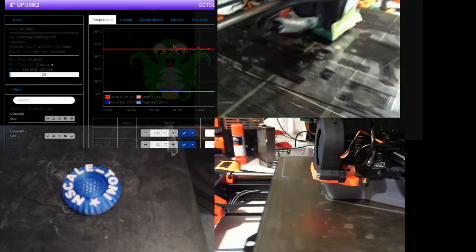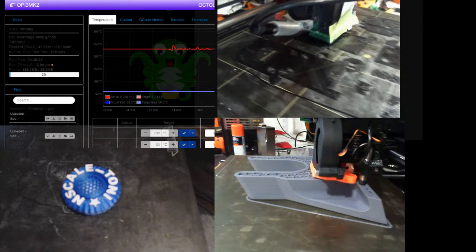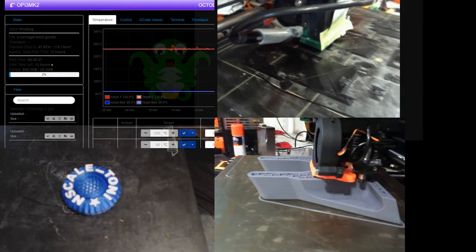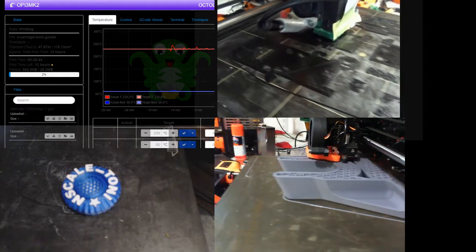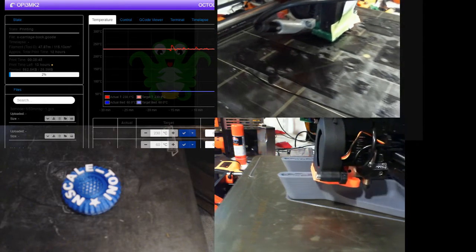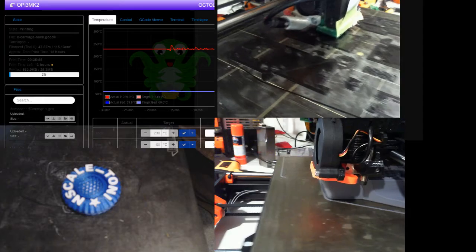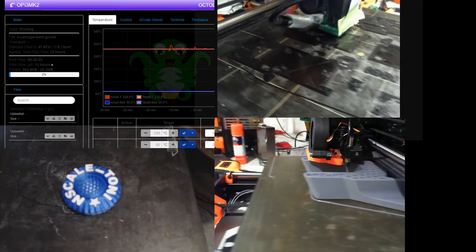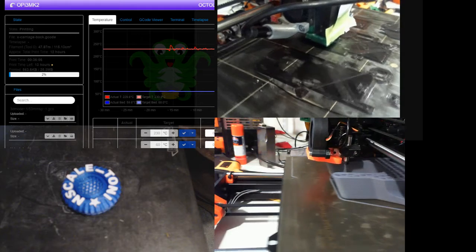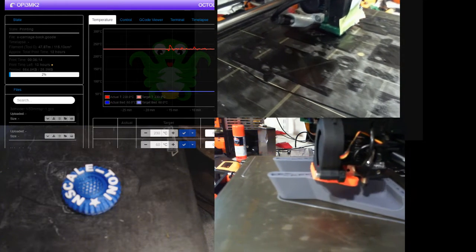Yeah, they can. Although, you know, there's a range of what'll work. It's not so much that they have different temperatures. It's when the plastic's in its molten state, if they're two different viscosities. So if one, when it's molten, is really runny, and the other one's pretty stiff, then, let's say you're printing the benchies, switching from one color to the other, you can't retract the filament out of the way. You just have to stop printing with, let's say, the gold and print with the red. And the red will push down and push through and kind of clean out the gold.